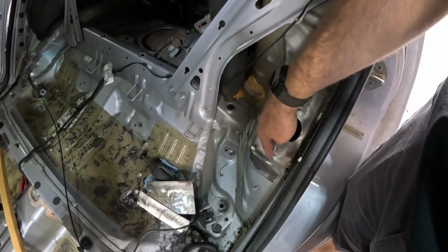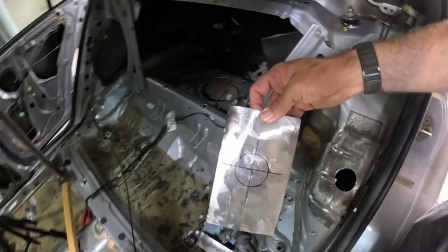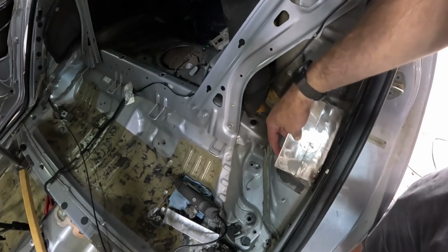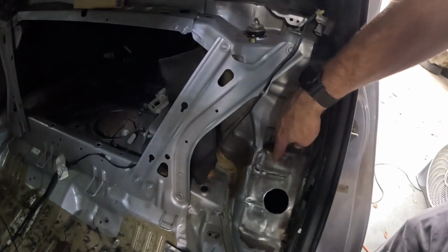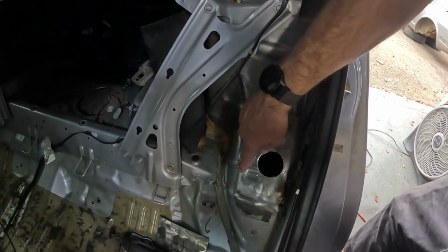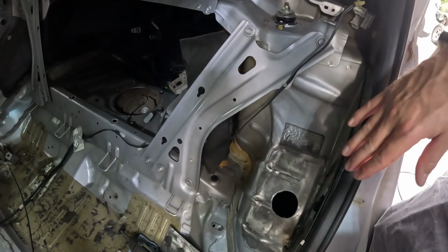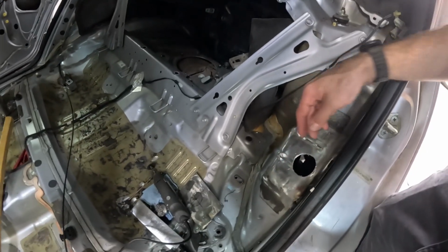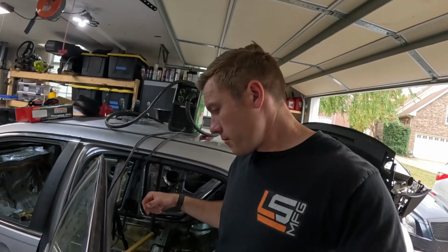So here we have the rear spreader plate area. Here's the spreader plate. It's going to sit like that. I just got to go beat this panel out a little bit from the other side. As you can see, there's these ridges. I just cut a slit down the middle of the ridge, beat it relatively flat, cut a hole in there, made a plate. My hope is to get the other side at least prepped today. See how far we can make it.